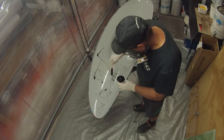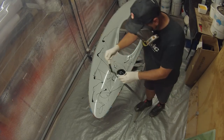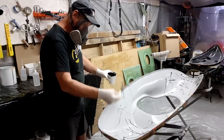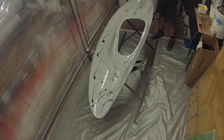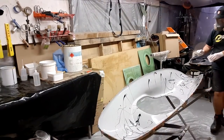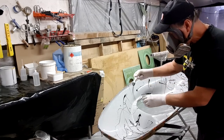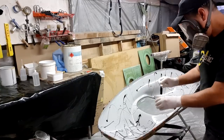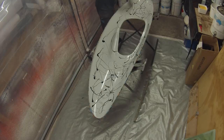So first up with the black gel coat, you'll notice here I have a tongue depressor or a large popsicle stick, and I trace and splatter and just simply drizzle the gel coat over the mould surface. As I mentioned earlier, I don't want to leave large blotches, and on occasion you can splatter a couple of larger sections. However, what I'm trying to do here is leave plenty of space in between to ensure that I get plenty of room to stipple that yellow gel coat in place, to avoid mixing the colors too quickly before I do a final smear over.